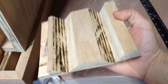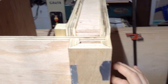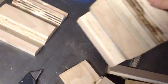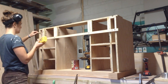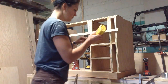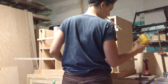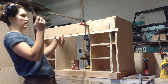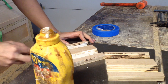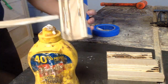Here are all my end caps taped together so they're easy to glue in place — that's how that final piece looks. Flush with the side, you can see the cleats in the back there, pin-nailed to those vertical partitions and then screwed. With the front off you can see those cleats in place — I put glue on all of these pieces, attach the front, then glue and screw it from the back side through the cleats into the panel. They're not the prettiest design, but you'll never see these cleats since the back side of the cabinet will be covered, and unless you stick your head in the door opening you'll never see them. They were the easiest way to attach that top facade without any visible hardware.